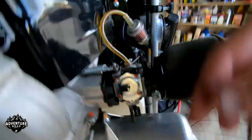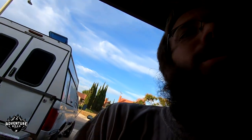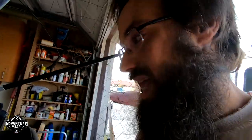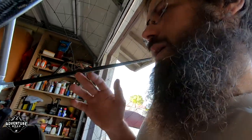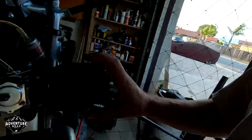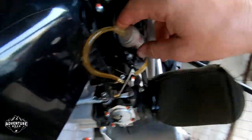So yeah — air filter, carburetor, fuel comes in, motor, air goes out. A motor is basically an air pump; it operates just like a compressor. You take fuel in and mix it with air at a 14.7 fuel-to-air ratio. Get that off and the motor won't run too far one way or another. A little bit off and it'll run fine, but 14.7 is generally the optimized fuel ratio for most motors. So air comes in here, fuel comes in here.